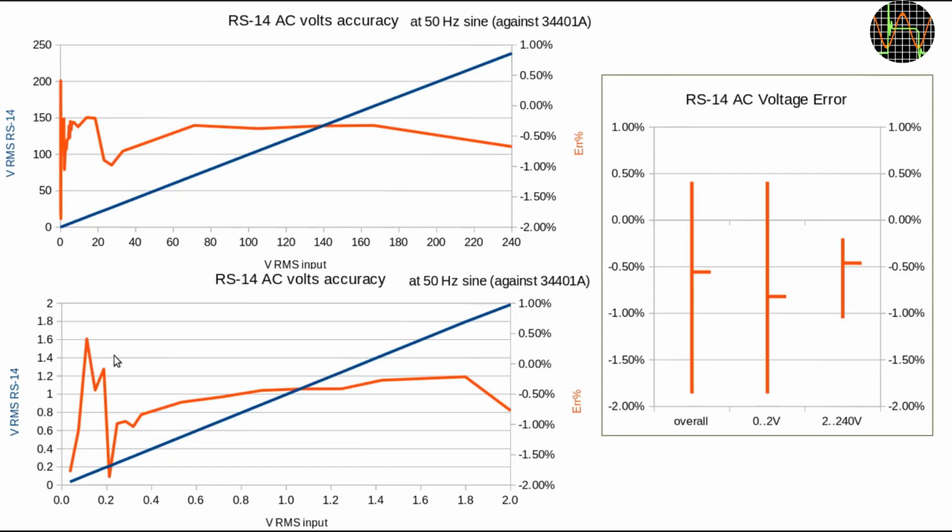with the accuracy itself. In the lowest range the RS-14 would show 1 mV as 1.0. If it gets just 1 digit wrong to show say 0.9, that is an error of 10% at that voltage. I talked about this effect in many of my previous videos, and you will see it a lot more in this one, so I won't point it out specifically in each instance.